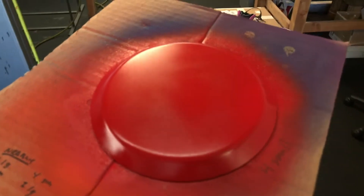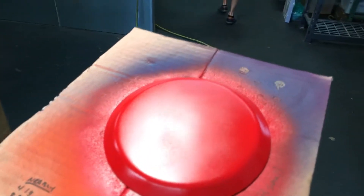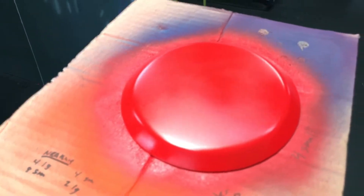So now I'm going to let the Cerakote sit — this is going to be the base coat for a stencil. We're going to throw it in the oven for about 15 minutes, lay down the stencil, and put the second coat over that.